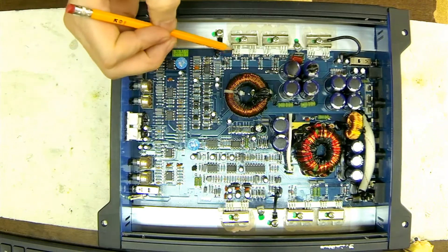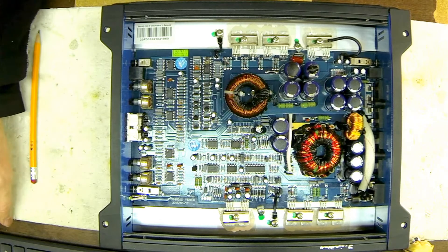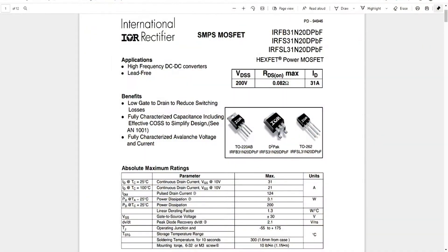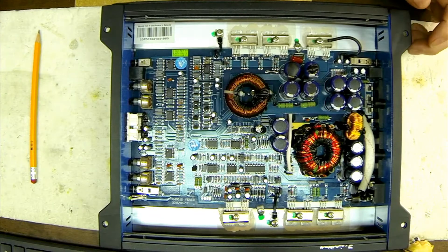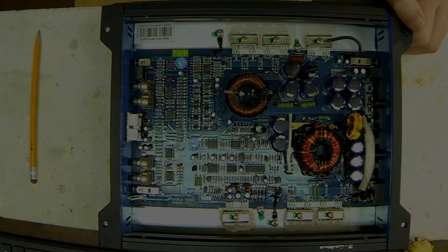On the outputs, the 31N20Ds — you'll see on the datasheet that the 31N20D has roughly a 30 amp current capability at 20 degrees Celsius. Now I will go ahead and disassemble this and remove the board from the heat sink.